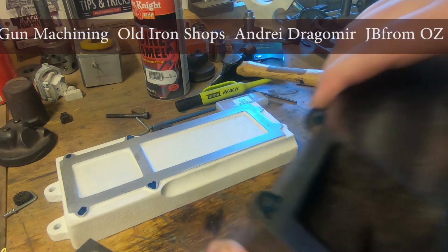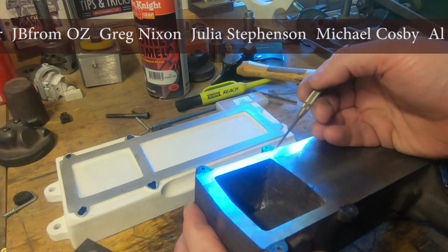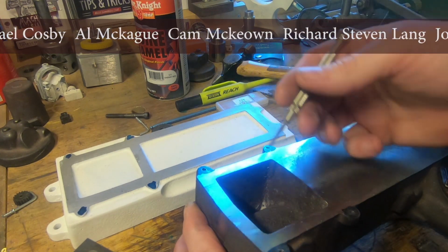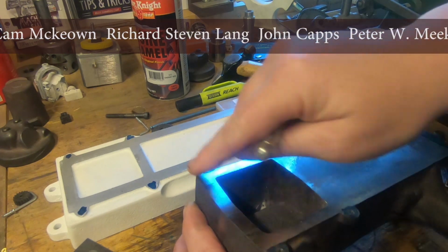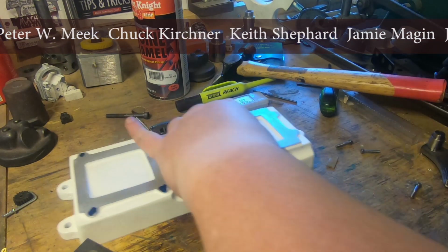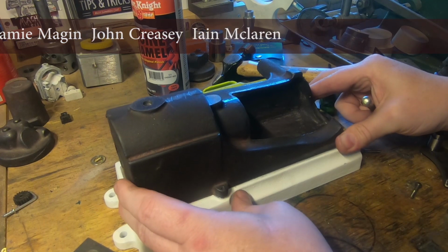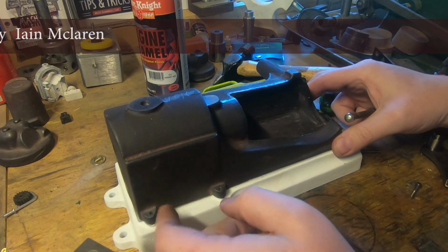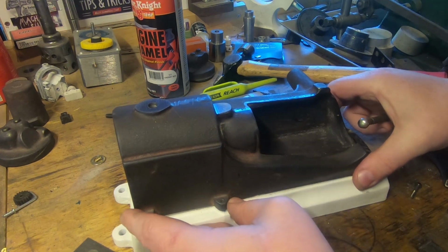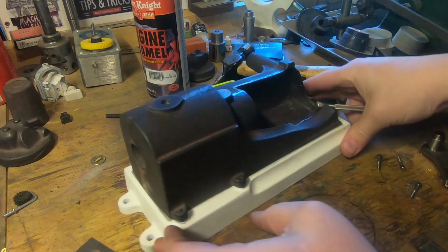So I've carefully drilled these holes tapping size for 4BA, which is number 31 drill, for a start. I'm going to open them out afterwards. They look in line this way. They're probably somewhere near there. I tried to get in the centre of the little dots, but probably you can't see both sides at once. So if we line these middle ones up, these will be a fraction this way, like a tiny bit, and these are a fraction this way, which won't hurt. So we want it nice and square with this one lined up, and hopefully this one lined up, and these aren't far out.